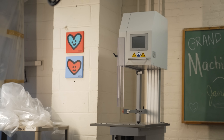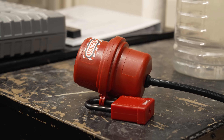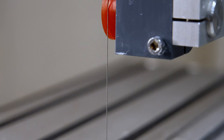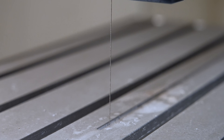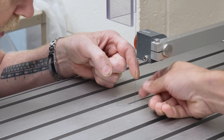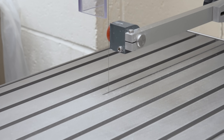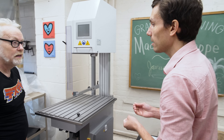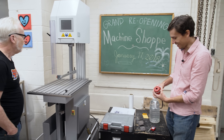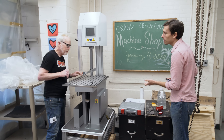This is actually my favorite saw in the whole world. It's so important that the person who set it up felt we should lock the power cord up — you can only use it with this key. It's a diamond wire saw. What you're seeing here is the blade — it's incredibly thin, and the kerf, the amount of material removed along the cut, is 0.6 millimeters. I love that because sometimes we need to make really fine cuts in hard materials and this is the perfect tool for that job.